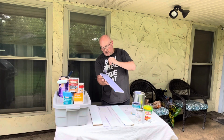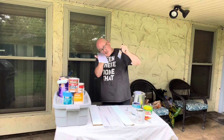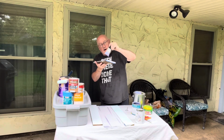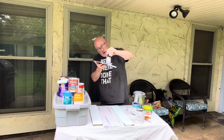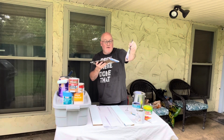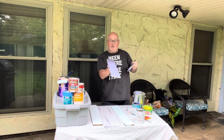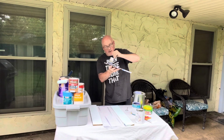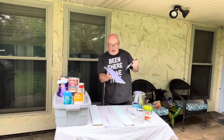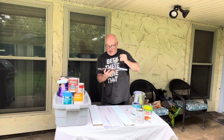What you want to do is you want to make sure that the entire surface is wet. So get your eyeballs down low against the surface and make sure you apply paint everywhere and got the shelf wet, right? You're looking for wet. And then pull the paint across it in long strokes. Long strokes. There's a deep spot in there, so I'm just going to fill it and then pull the paint across it in long strokes. Looks like the green is showing through, so I'm just going to pull across there.